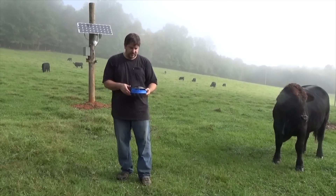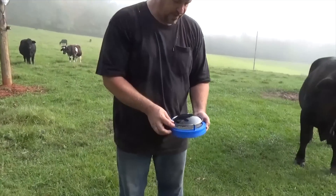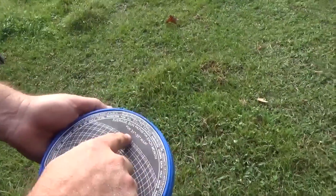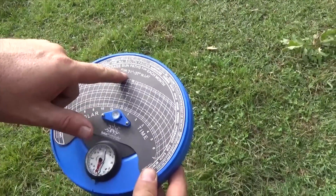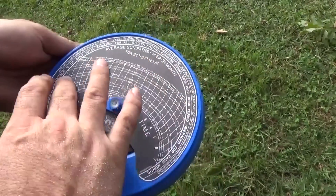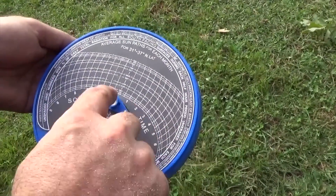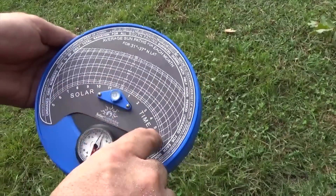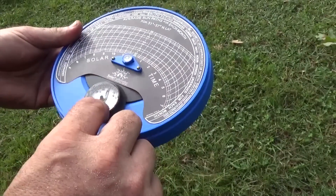Come on over here and see what we're talking about. On a Pathfinder, there are different sheets for different latitudes. This one's for 31 to 37 degrees - we fall in at about 33-34 degrees, so this is the sheet we want. It shows all the solar paths for the entire year, from June all the way to December, including the time of day and the amount of solar energy you're going to get. It also has a compass, which is very handy.